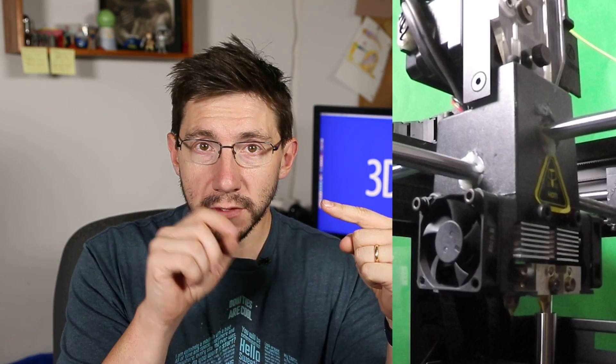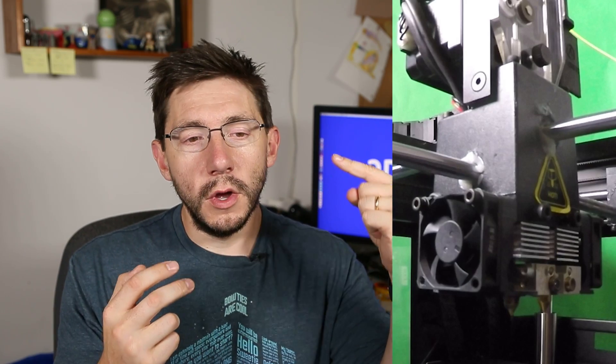The problem was that in the giant mess of filament, a small piece got stuck in the fan blades — the fan that blows across the metal fins on the throat. So there was no sinking away of the heat, no break in the heat. The filament got warmed up in the throat, expanded, and it just clogged like the dickens.